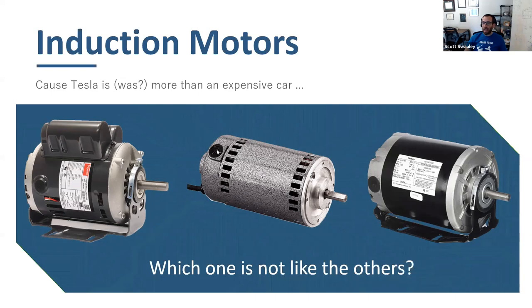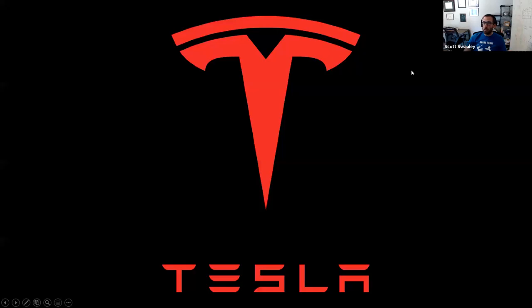The one on the left is a single-phase induction motor — I can tell because it has starting and run capacitors. The one in the middle is called a universal motor, and that's the odd one out. You can tell because it has a little access port where the brushes are. If you've used a saw or Dremel and seen sparks out the back, that's a universal motor. It has a commutator inside — literally a mechanical switch making and breaking contact thousands of times per minute. I realized induction motors made up most of the large machinery — grinders, band saws — and they have a property where you can actually use them as a brake without modifying them.